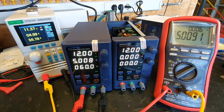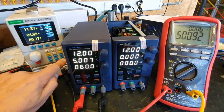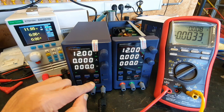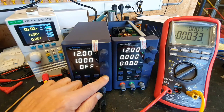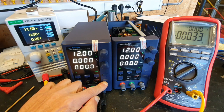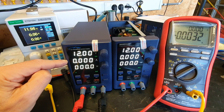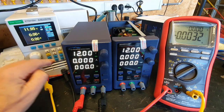The fan already stops. Let's switch the load off and go back. Set to 1 amp and switch it back on — the over-current protection is not switched on, so the load still pulls 5 amps when switched on.